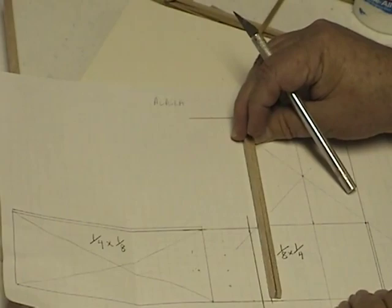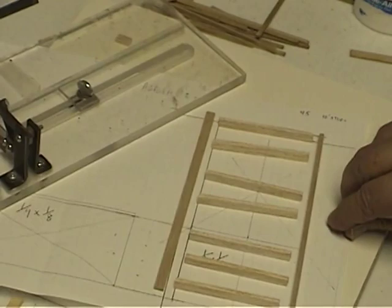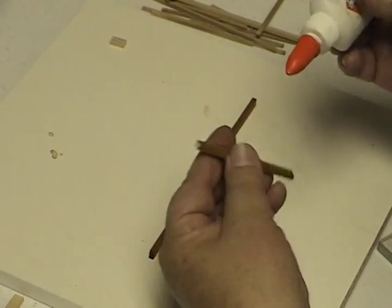Now for the cross pieces that go in between, for our foundation for this, we're not going to build this accurate according to building code. We're figuring nobody's going to pick it up and look at the bottom of it. So I just line those two pieces up for my outside piece and take the piece here that goes in between and cut it to that length, and that way it's going to be just right. So I've got several pieces there and I just stain them the way I want them to be stained, and then I just start gluing these cross pieces